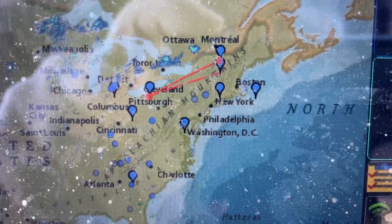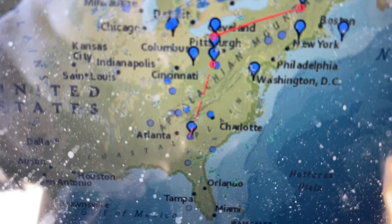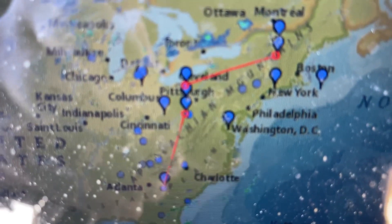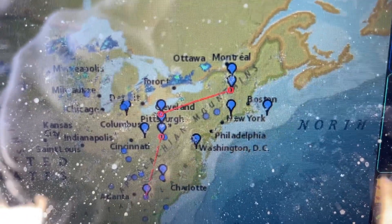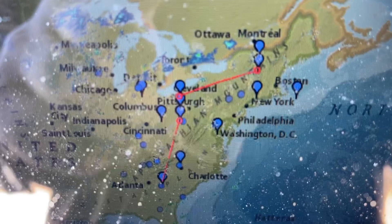I've started the Grid Tracker program and you can see the spots on here are all very localized — nothing out west, nothing real far south yet, nothing real far north. All of these are very centralized. There are a few in the northeast, but most are in very surrounding states. It looks like we've gotten down to almost Georgia and up into the edge of Michigan, maybe up into Pennsylvania and New England a little bit. This is very much what we're looking for — close proximity signal propagation compared to what we'd get with a high antenna 18 to 20 feet in the air on 40 meters.